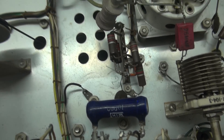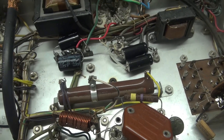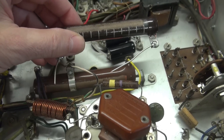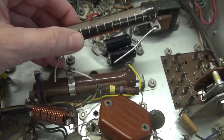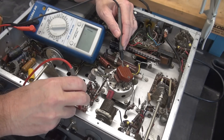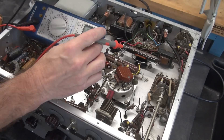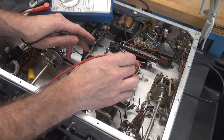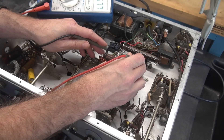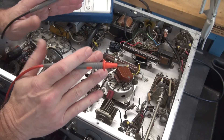Here's the plan: I found a direct replacement for the open 10K, so I'll swap that out. For the 20K I didn't have one, so to test this thing I'm going to strap in a 10K from the center tap to that post, which should make the screen circuit happy. New resistors are installed. Now pin 2 from the screen comes over through the 10K resistor — we didn't have that before — and now that open section on the 20K will be bridged by the new 10K. I should have screen voltage on the output tube now.